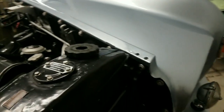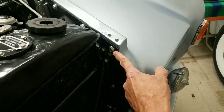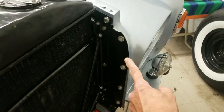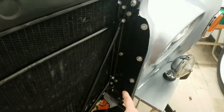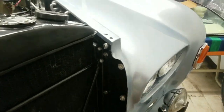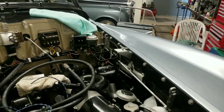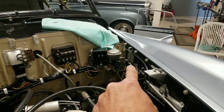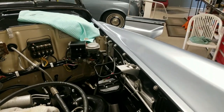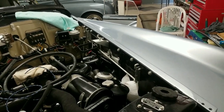This one has a half inch head on top and a 7/16ths on the bottom, and that holds your air cleaner. And this one, for whatever reason, was a 7/16ths inch head - I think that was re-tapped out. But you'll notice they come down through here. These bolts that hold the frame to the wing, you have to loosen those - I had them tight but you had to loosen those. And there is a bolt right back here in the back that holds the wing. You've got to leave them all loosey-goosey until you get it in.